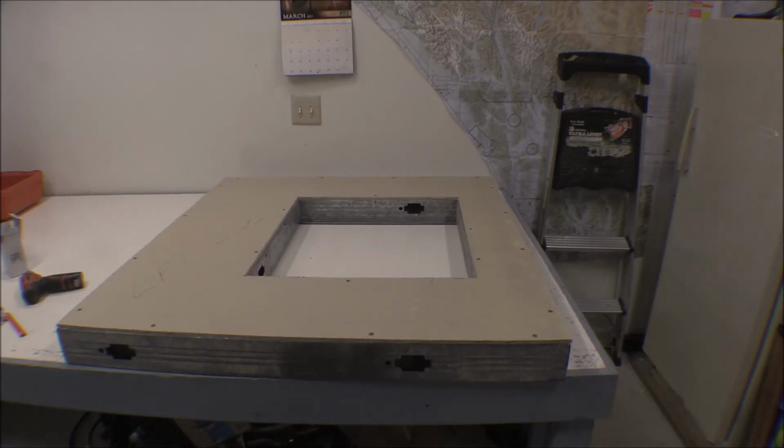That side's done. I laid these frames down on the cement boards out on a couple of sawhorses. I put a couple of boards down on the sawhorses to support the whole sheet, and then put the sheet on top of the boards, and then laid the frames down and drew out my pattern, drew out the size that way, and just cut it out with a circular saw with a fiber cement blade, Hardy blade. The center of this, I laid the pattern out with pencil, and then just made a plunge cut with the circular saw and cut that out like that.